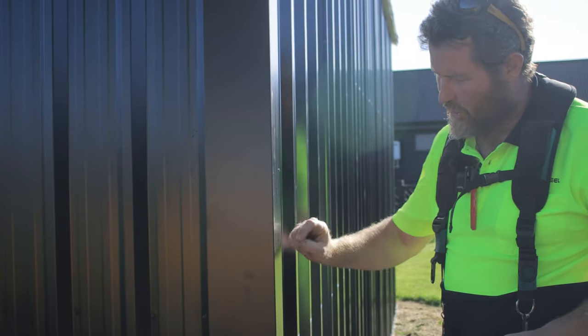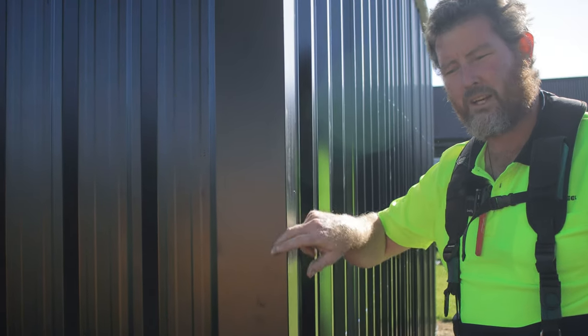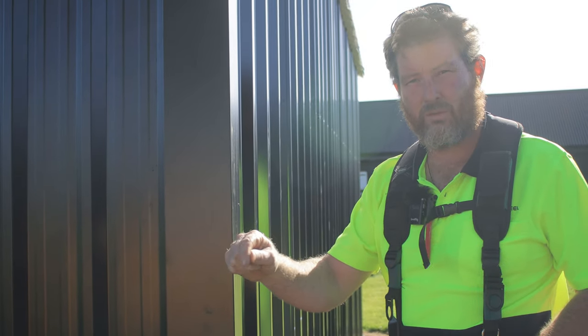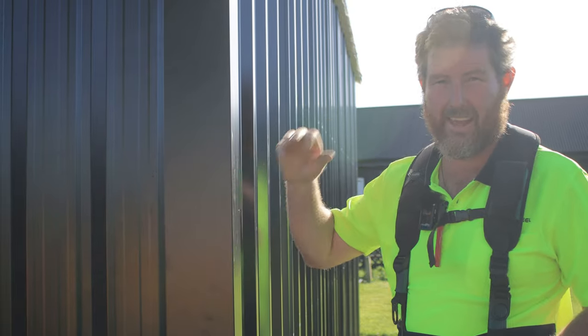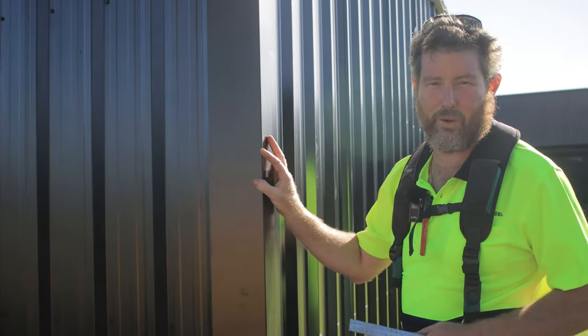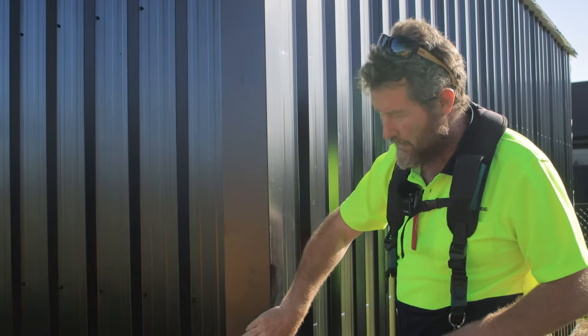And then what I often do is with a Vivid, just write where it is, the sizes. So then when I get all my flashings turn up, I measure my flashings, write it on those, and then it's easier to allocate to it. You often think at the time, oh, it'll be easy, I'll know where it all goes, but a week passes and they all look the same. So we've popped that one on.